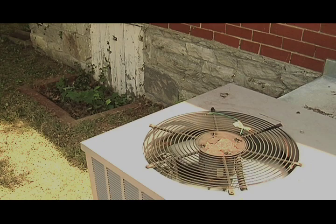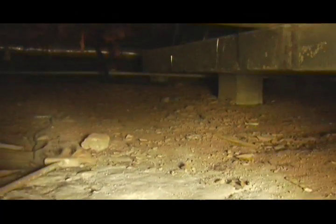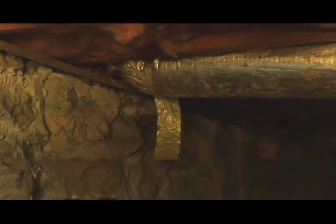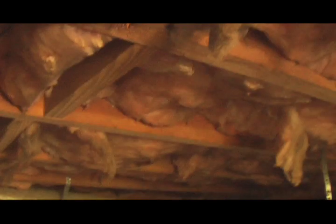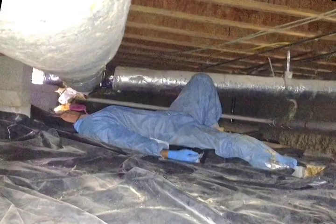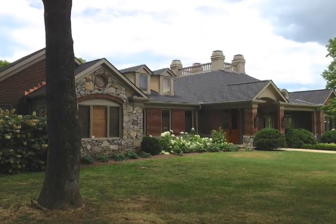But even more important to most of our customers is the influence it has on indoor air quality. Duct systems are typically underneath the home in the crawl space or up in the attic. Both places have a lot of contaminants. Underneath the home in the crawl space, you have dirt, you have pests, you have potential radon concerns, mold. Up in the attic, you have a lot of fiberglass insulation and other contaminants. By effectively sealing the duct systems in those two environments, we're helping limit leakage from those spaces into the home.